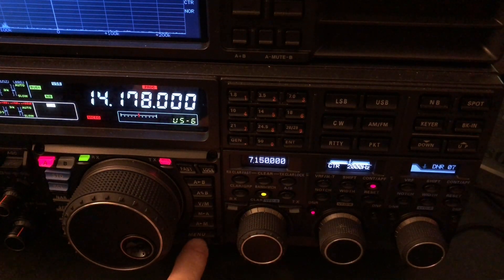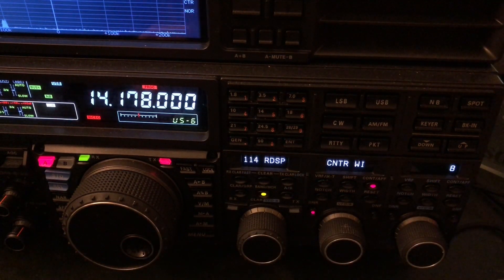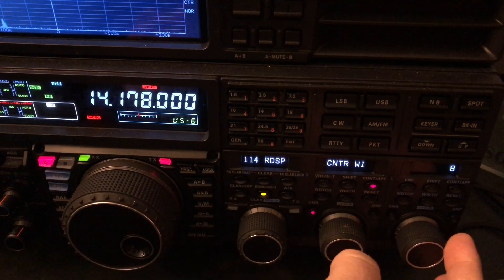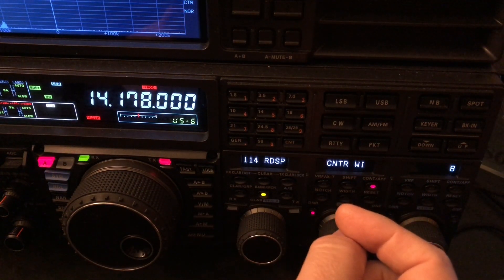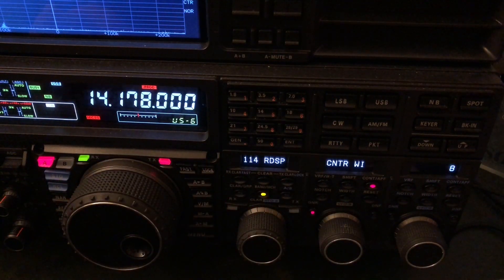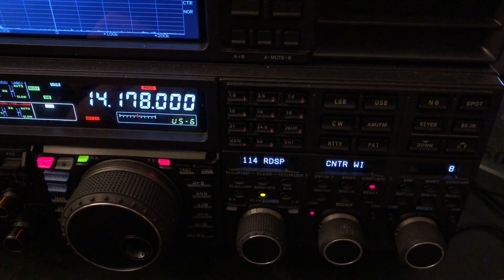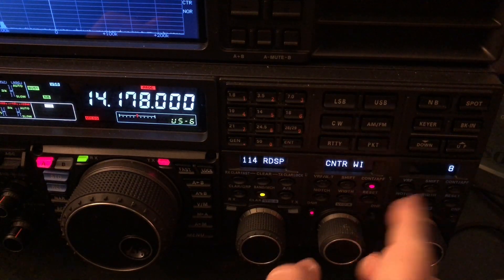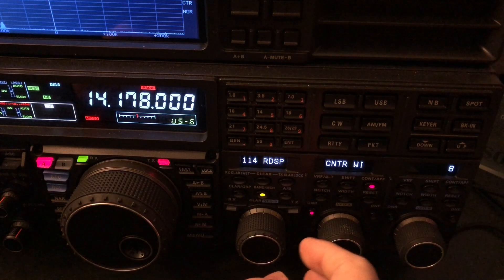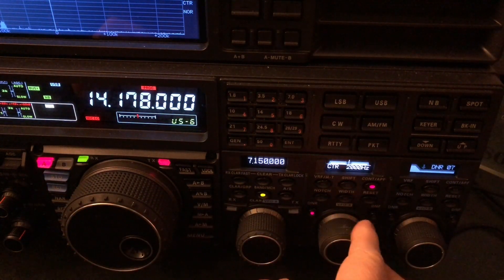While I wait to see if he comes back, let me go into the menu and show you that I like to change the width down to about eight. I find that's a good compromise where it restores a little bit of the fidelity, a little bit of the highs. The problem is that area around 2000 Hz where we can get intelligibility out of the human voice also drags in a lot of noise, which is why I prefer to cut instead of boost. Yaesu out of the box has it set to cut negative 15. I'm going to put the width on eight instead of the factory default of 10. You can see here it's scooping — we call that a scoop.